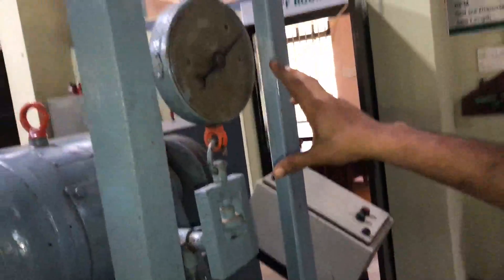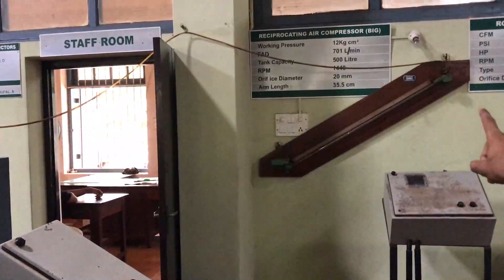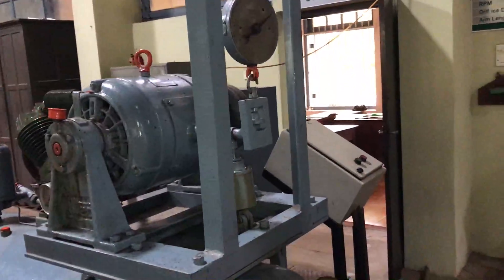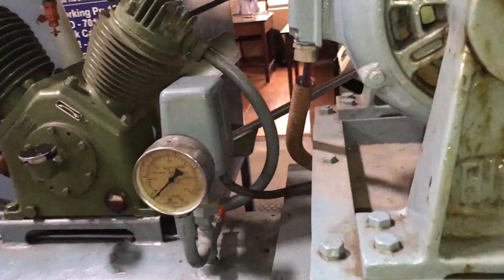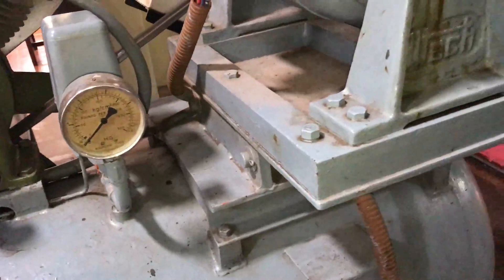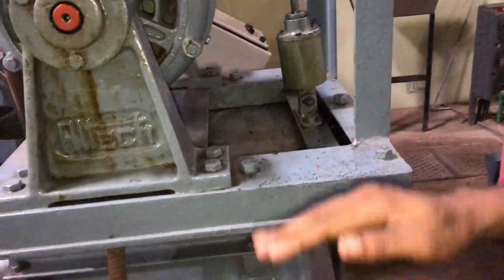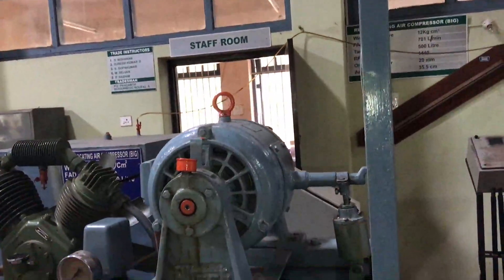After making the needles level, take the load reading, then the manometer reading, and check the RPM using the tachometer. Once this set of readings is done, close the delivery valve fully again. Pressure starts to develop again. When the pressure reaches 3 or 3.5, open the delivery valve and adjust it so the pressure remains constant at 3. Again take the load reading, RPM, and manometer reading.